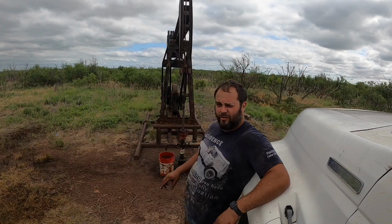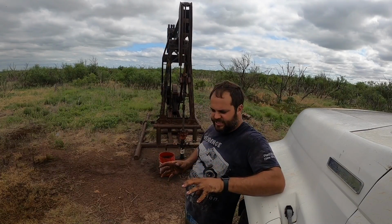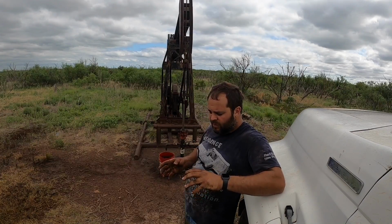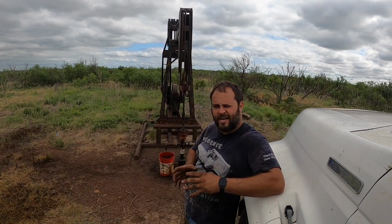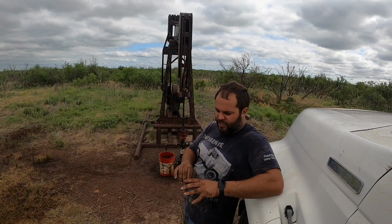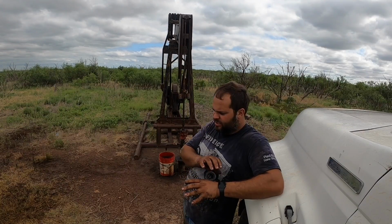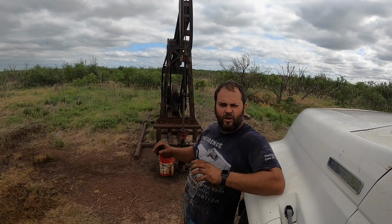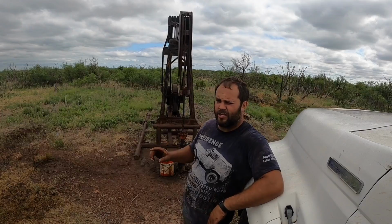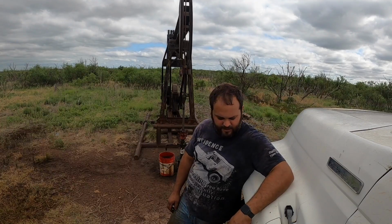One thing to consider is that this formation we're pumping is effectively new. It was drilled in the 60s, like 68 or something. They open-holed it in that lower gun sight, and the records say there was a huge inrush of gas with oil mist. Cuttings went from the bottom of the well to the surface in 10 seconds. It's a huge volume of gas.